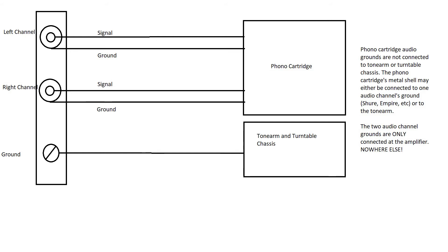Balanced audio inputs, whether they're real or pseudo, provide better noise isolation than unbalanced inputs. And only having the ground at the phono preamp prevents ground loops — say between the two channels — which can pick up hum even when you're trying very hard to avoid it.